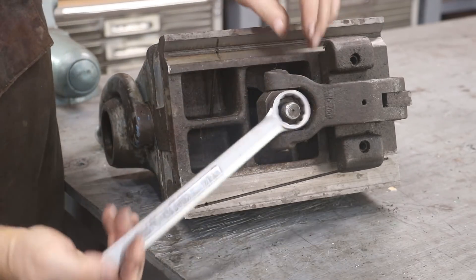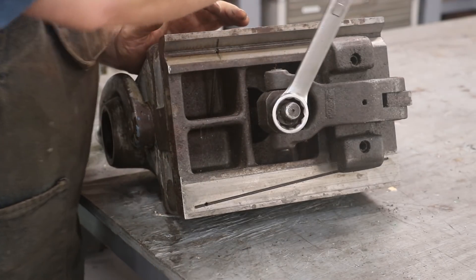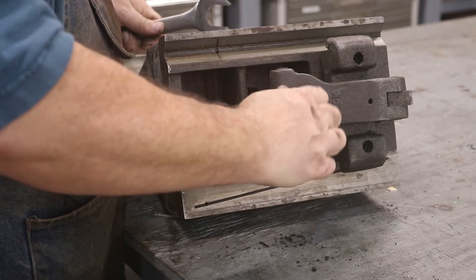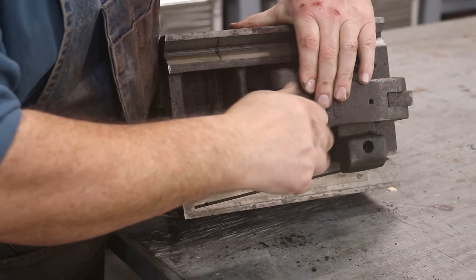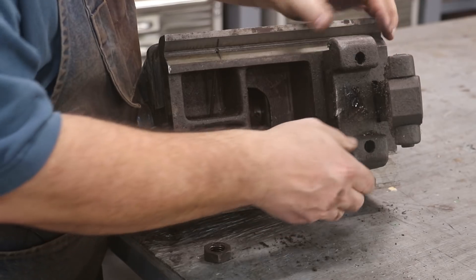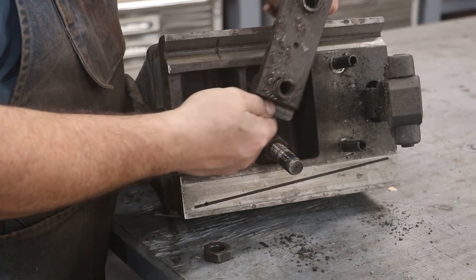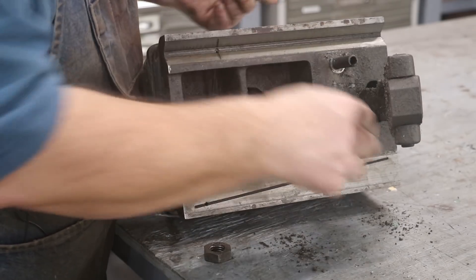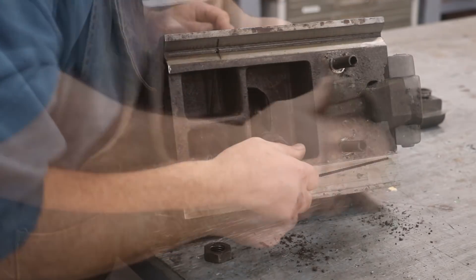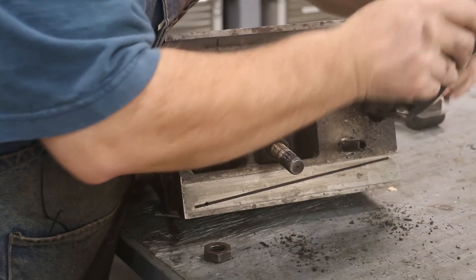Just had to get the right angle on it. Let's take that nut on off. It appears that this is spring loaded here. I'm going to pull that out, and that rides on two pins, and there are some springs right there to push back on it. You just got some pins holding that in. And this unscrews here — let's go ahead and take this whole assembly out.